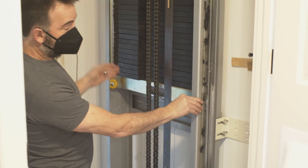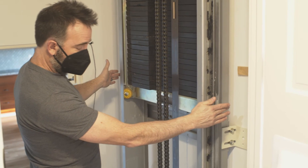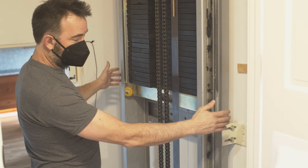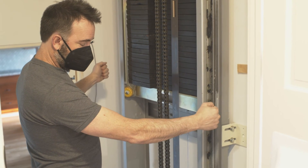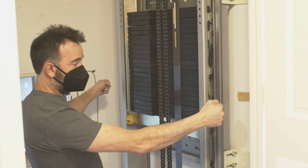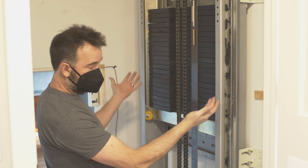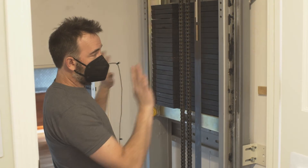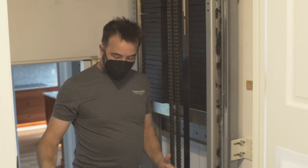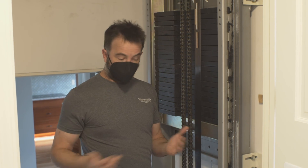The rail system here is a very sturdy, very stable rail system. The T-rail is mounted on each side. It gives it a good stance — the cab is going to be sliding on this, and you can see it's very wide, which helps keep the cab stable from wobbling. We call this a cantilever rail system. This is the most common type, where all of the support is on one side and the cab is cantilevered off of that rail system. This is how the hoist weight on a chain traction unit looks and how it operates.